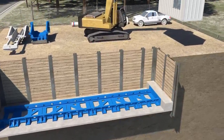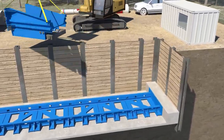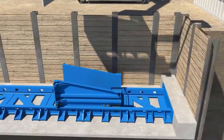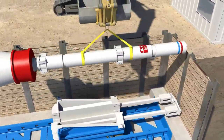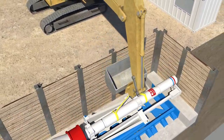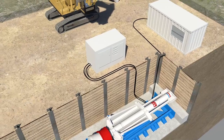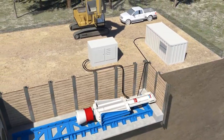Next, the control shack is installed in an appropriate location. With the control shack in place, the hydraulic press assembly is mounted on the rails. Then the hammer support cradle is placed in the press assembly. Once the press and support cradle are installed, the hammer can be placed in the cradle. The final step is the connection of the hydraulic lines. Once the bore pit is constructed, the HydroHammer can be installed in a matter of a few hours.